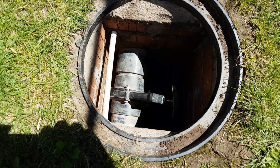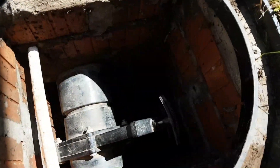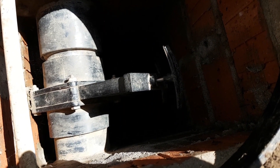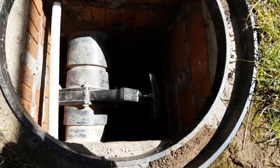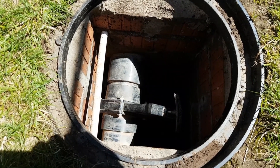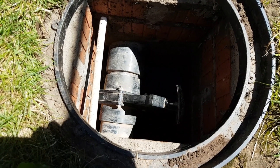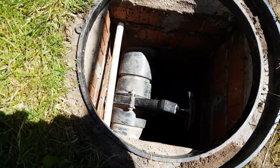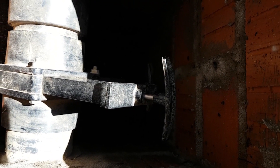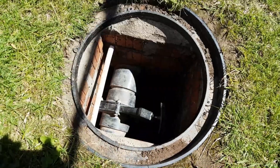Here are my two gate valves that control the winter and summer run. The bottom one, which is wide open, is for the bottom drain. The top one I have open just a little bit, so there is actually water moving through that top pipe. If you shut it off altogether, the water in that top pipe would become stagnant. You do need a little bit of flow through that pipe to keep the water fresh — otherwise it will go stagnant on you. The bottom one is wide open and doing all the work.